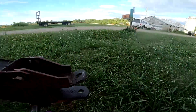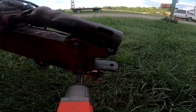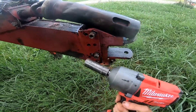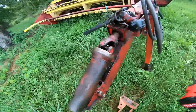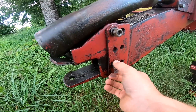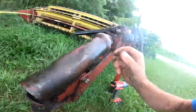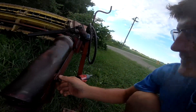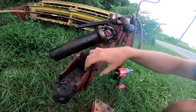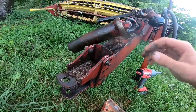We've got a couple more of these to quick buzz off here. We're done. And that's the other thing I've noticed about the impact — when you see it kind of stop after the ugga-duggas, this one must be able to load-sense. It will kind of stop and hesitate when there's no load on it, especially when loosening. It'll do the same thing when tightening — there are different tightness settings, and it behaves differently with no load versus under load. Save our lock washers, pop these out.